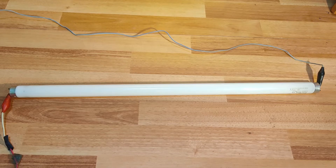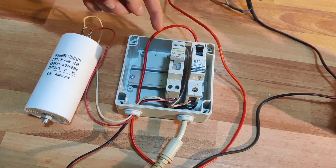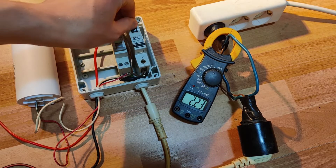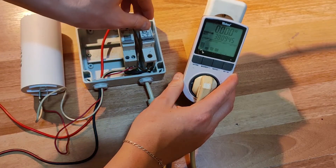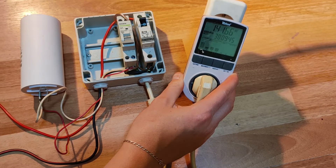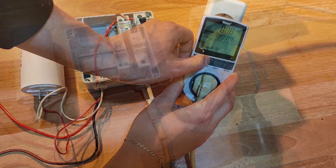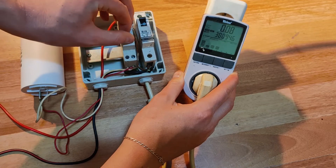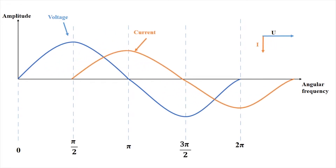As you can see, there is enough energy stored to flash this tube. For the high voltage capacitor bank, it is enough to short the Jacob's ladder with the screwdriver, so the energy is discharged through the secondary windings. The idling current drawn by both of the transformers is a little over 6A, but only 140W of active power is consumed. This means that most of the current measured earlier is used as reactive power. As you can see, by connecting the capacitor, the current is dropped by almost 40%. However, the capacitor was initially oversized for using 4 transformers, so the setup is actually working with a slightly capacitive power factor. If you want to know more about this subject, I suggest you go watch the video in the description.